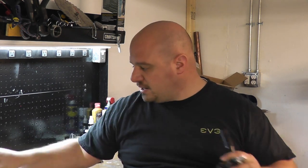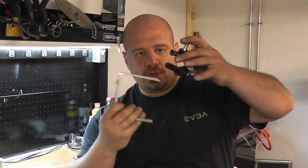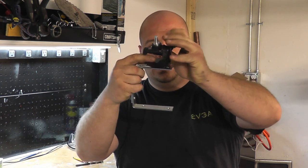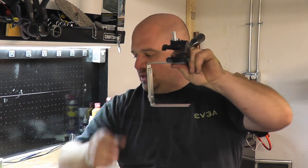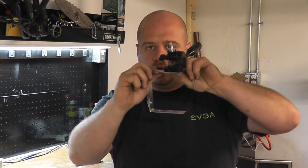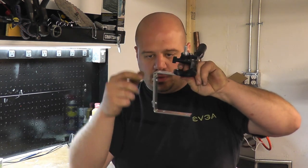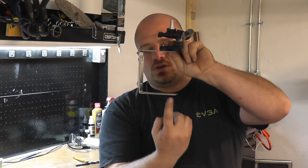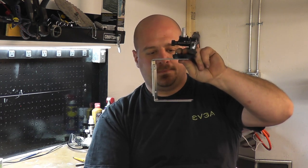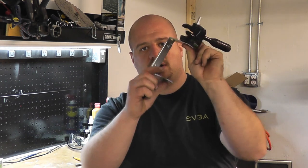so we need another bracket to make our camera upright. And I just have two pieces of angle bracket here, bolted together. And what we can do is just hold that like so. And to make this extra stiff, and also because the little screw on these adapters don't go all the way through, I'll probably pull this one out and just drill a hole and sandwich the whole mess together with a bolt straight through. And then I could take that 1/4-20 screw and put it right in the bottom here and into my camera. And that's our bracket.